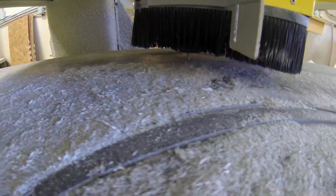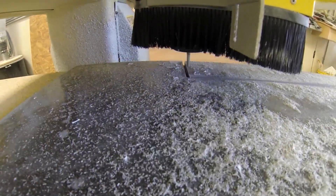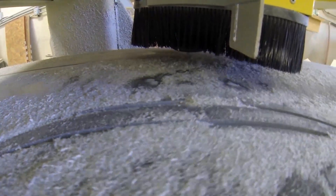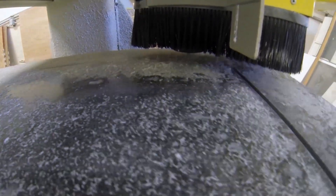What you want to do is cut the inside pieces first — like the trivets, the sink cutout, that kind of thing — and then go all the way to the outside of the material. As you cut these pieces they fall off the larger section, because the larger section is going to have the greatest suction down onto the CNC, which means it won't move.